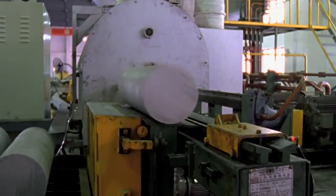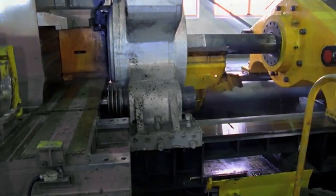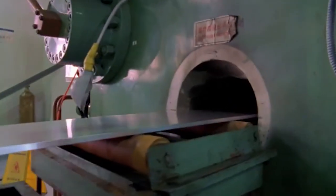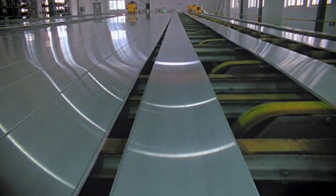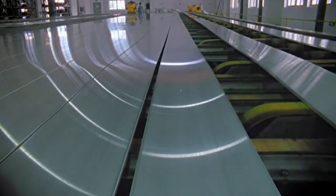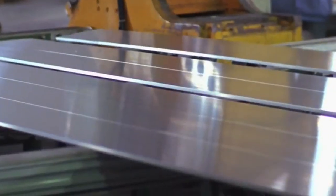This material is brought to the machine factory in the form of huge multi-ton cylinders of purified aluminum. These are then warmed up until they are moldable and passed through a press that turns the cylinders into long sheets just a little thicker and wider than the planned dimensions of the laptop — much like how a pasta press might change a dough into long fettuccine.